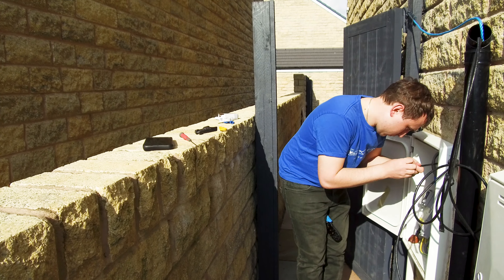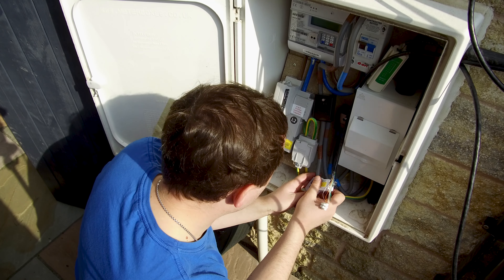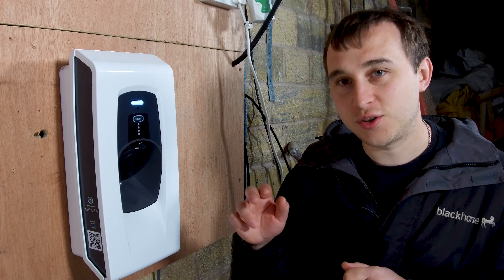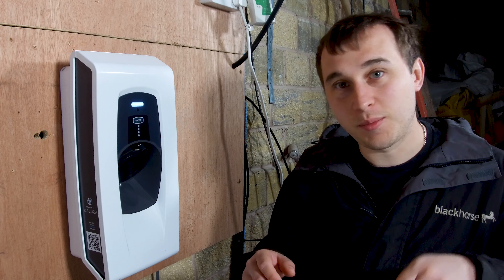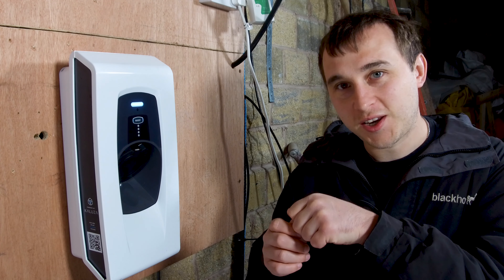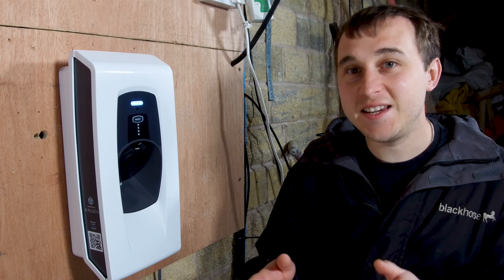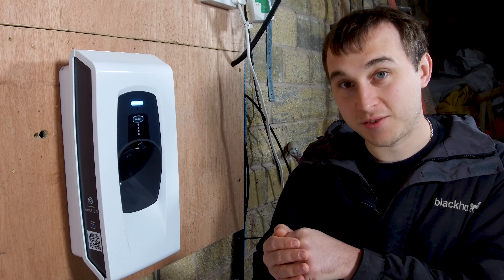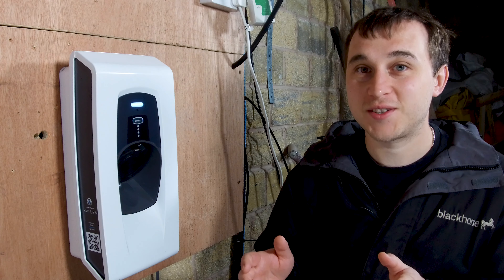Most people, including engineers, don't like doing RJ45s because there are lots of cables cramming into a small space. A little trick: you only need the two blue cables in the two centre pins - that's absolutely all you need. However, if you want to do it properly, there's a link below for a special pass-through RJ45 terminal and crimping tool - you push connections through, check them, crimp it, and it cuts the cables. Really one of the easiest terminal tools I've ever used.